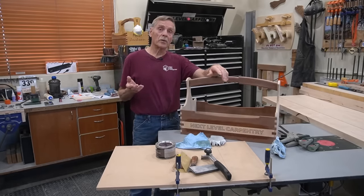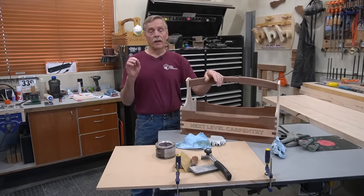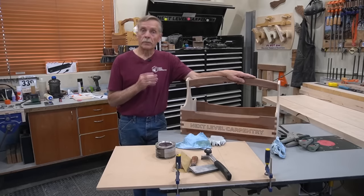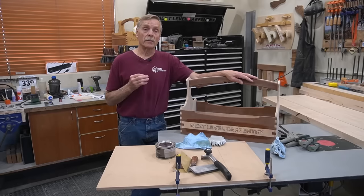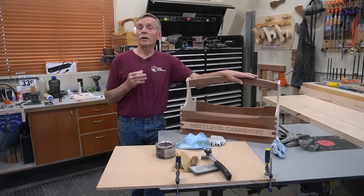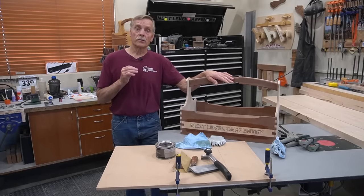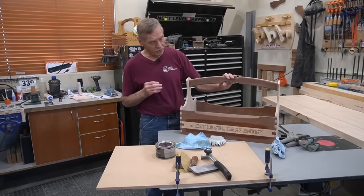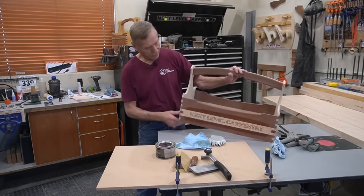And I hope the takeaway for you viewers is how fast and effective that thin CA glue works as a sealer to keep the epoxy from bleeding, because despite anything anyone can say about the subtle color of that epoxy with mica powder, there's no question about the effectiveness of the thin CA as a sealer for preventing epoxy bleed. And so I hope you think that this little demonstration justifies the extra time you spent watching this video to the end.